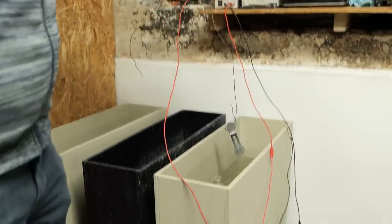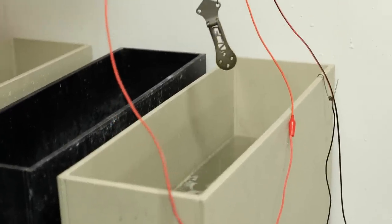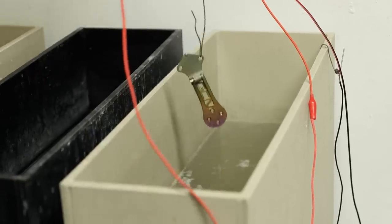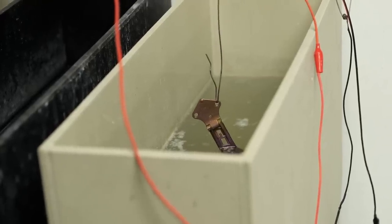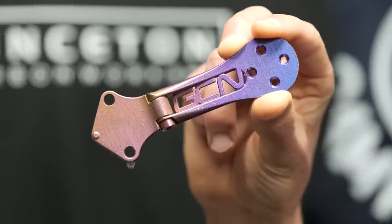That's all being etched now. Get it in to anodize it - you can see it's starting to change color. Look at that - it's like actual magic is going on in there. Every time I basically expose it to the voltage, it creates a slightly deeper oxide layer, and that's what's changing the color. It just appeared right in front of your very eyes. It's not every day you get to see that.